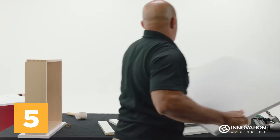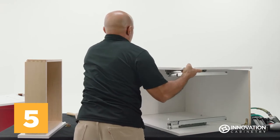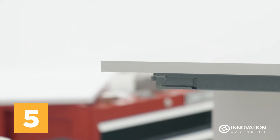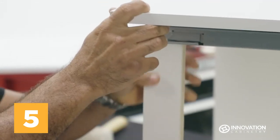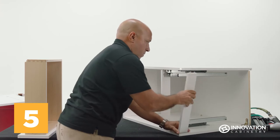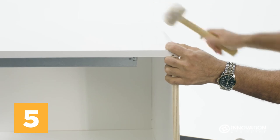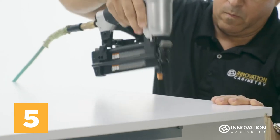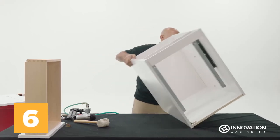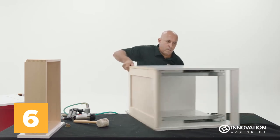Retrieve the base's other side and fit it on top of the unit with the pre-placed wooden pegs and pre-drilled holes. Fit the bridge beams in place on the sides — these sit on either side of the drawer glide track. Gently tap all pieces into place with a rubber mallet, then use a nail gun to secure where the topmost side meets the base's bottom, backing, and bridge beams. Next, flip the unit over on your workstation and repeat the process to secure where this side meets the bottom, backing, and bridge beams.